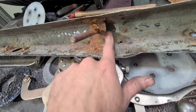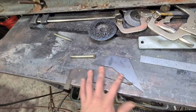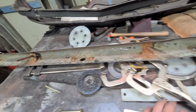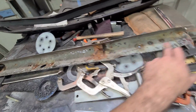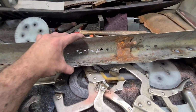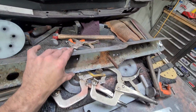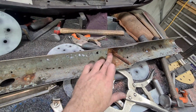So make these little plates now with the bolts. So I've got some bolts and got some scrap plate. So I'll cut them out now and then figure out a way to jig it from the end points and the number plate reference and get it in the right spot, because it's not the center, it's actually offset, sitting upwards. So the depth will also be a factor as well.